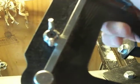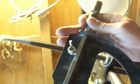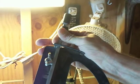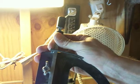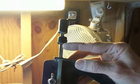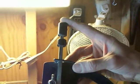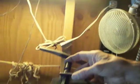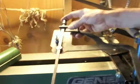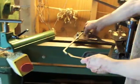The other thing that this caliper does is you can slide it up here and slide this into the form, and then it will tell you how deep the bottom of the form is. You can put that down, and then you look up here, and this will tell you exactly how deep the bottom of the form is, so it'll keep you from cutting into the bottom. You spend all that time going through the hollowing process, and then you end up cutting the bottom off, and you don't want to do that too short.